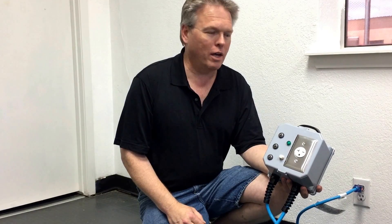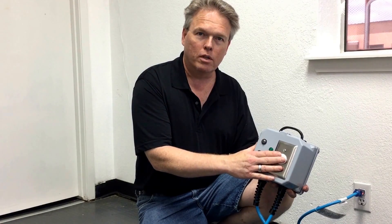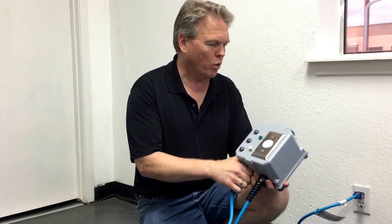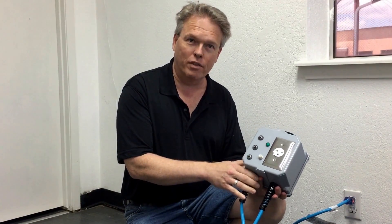Hi, I'm Donald with SteamBright Supply and today we're going to talk about our power adapter that has the NEMA 6-20 receptacle. This is a 240 volt receptacle that you can operate up to 20 amps in, and this particular power box actually joins two regular household 120 volt outlets to make 240 volts basically on the fly.